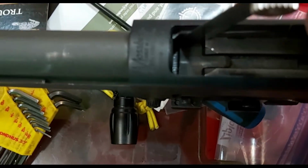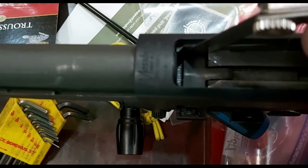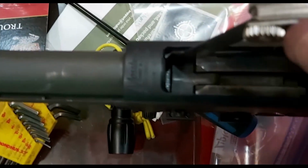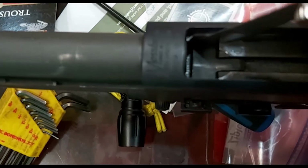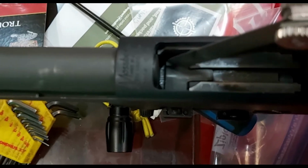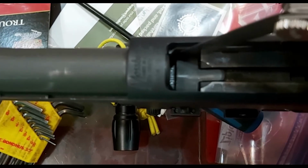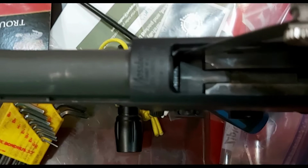And when I put this in here, by making the elevator a little bit wider, it helped push this back just a little bit more when I was opening it, which kind of brings me to think that the root problem here is really that this should be a little bit wider. The elevator should be just a little bit wider in order to ensure that it pushes that back just a little bit, gives it a little help to make sure those two leading edges don't collide, because that's what really starts it.